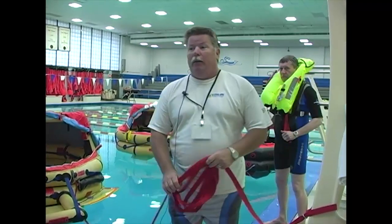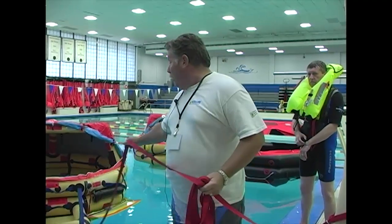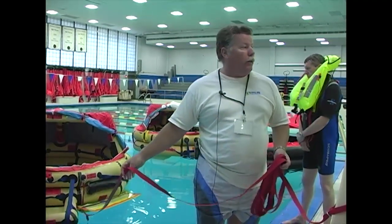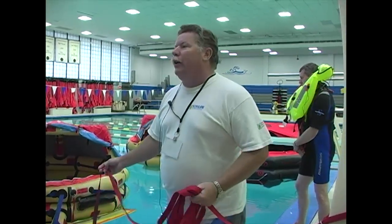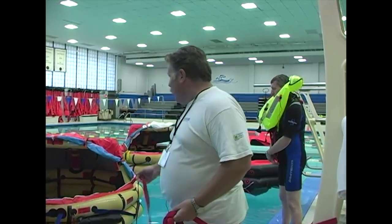Make sure if you have to deploy a life raft that you put it over the side — do not deploy it on the stern of the boat in hopes that you might need it later. When you deploy a life raft, you saw how quickly it deployed — about 10 to 15 seconds. Life raft deployment is the last thing you're going to do before you leave your boat. You've done everything else to save the boat, there's no saving it, we've got to go. A lot of people have damaged their life raft by deploying it on the stern and then trying to move it. Life raft is the last thing to go in, last possible second. As you saw, you can deploy it and dive right in — off your boat in less than 15 seconds.